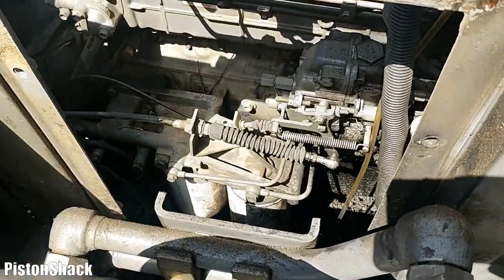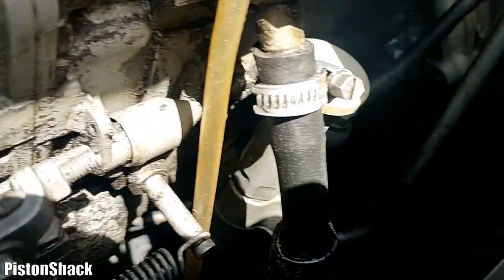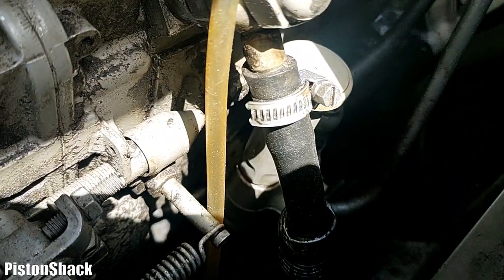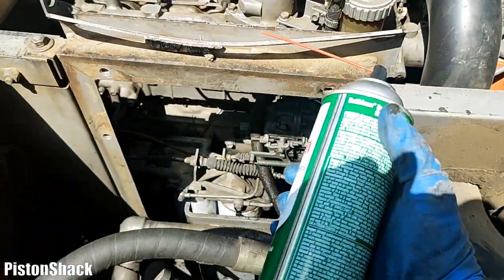As you can see there is a fuel injection pump, and on the side of the pump is our fuel lift pump. That pump has a slight leak - it still works, but if the machine sits for a little while it will let some air get into the fuel system and then you have to prime it - not good.